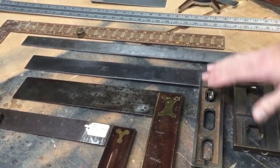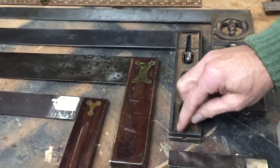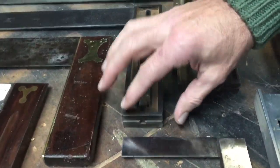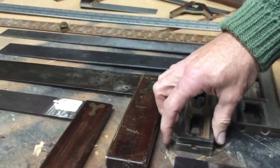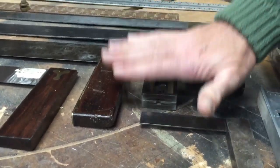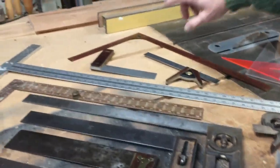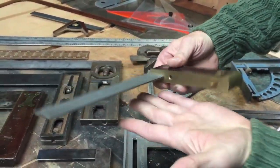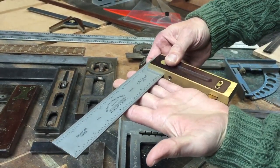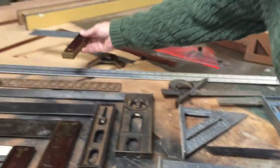set at. This one here is only 90 degrees, but it has a little feature here that you can pull out, and that will keep this from turning when you're measuring across a board. It actually has a little piece that'll come out and sit on the edge of the board, as well as the new Bridge City level also has. So that way when you're sitting it on a board for your square, it actually will sit flat, and then that can be tucked away.